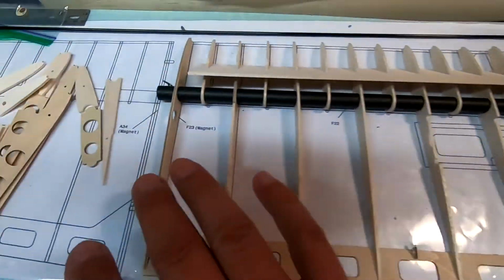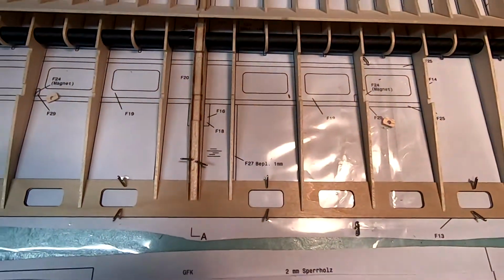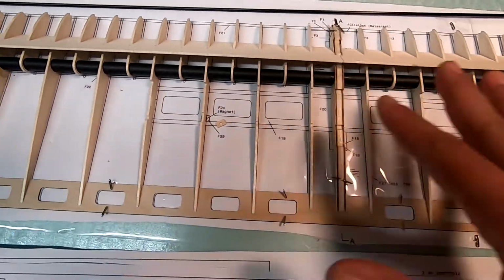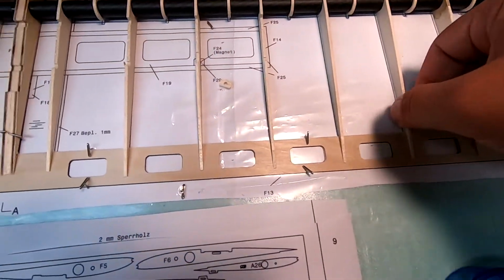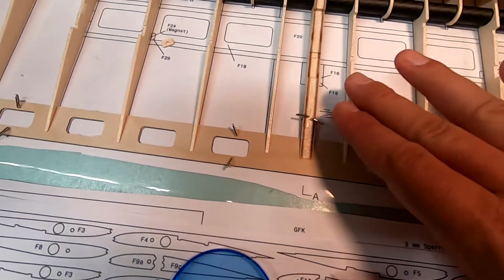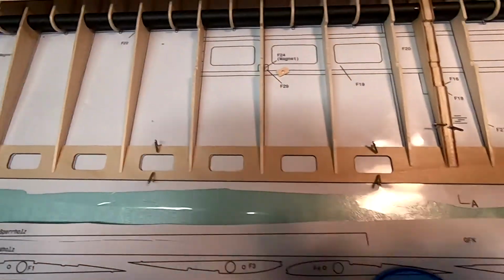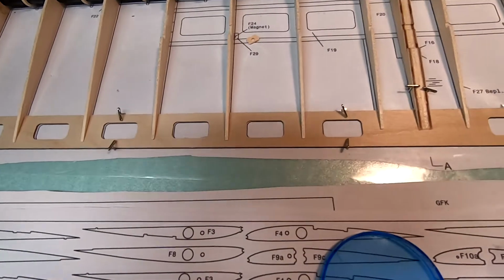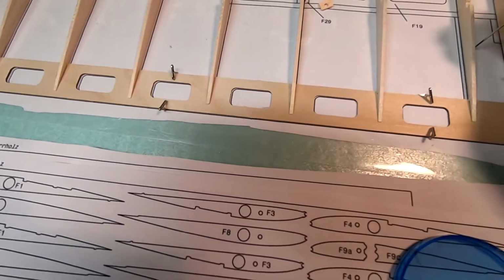This is identical to this, so those two ribs provide an outer square, assuming that this piece is at least cut equally and is itself square. Everything should be good. So by pinning this back, that lets these ribs drop into their correct notches and be nice and solid. So now, instead of putting weights on there, because everything is held down firmly at this point and I don't think that's necessary, I'm going to put a pin basically next to each one of these. Sorry, I'm just trying to get my hands on one. And so I'll just pin them in place